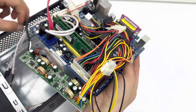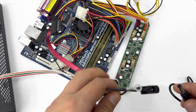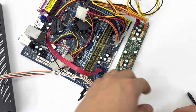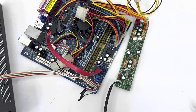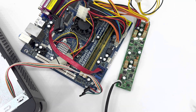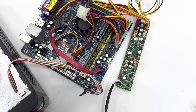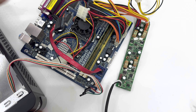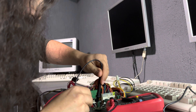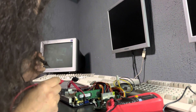After a bit of searching online I was unable to find this exact PC or any of its specs. However, I did find some other thin clients using the same motherboard, and some of them used 19V — like what you'd use with a typical laptop — or 12V, which also made sense since that's what the motherboard itself uses, along with 5V and 3.3V. I tried both voltages to see if it would turn on or react in any way, but unfortunately no luck. After checking the voltages on the 24-pin connector, I could see that something was definitely wrong with the power delivery since the voltage wasn't being stepped down to correct values — it was all out of whack.